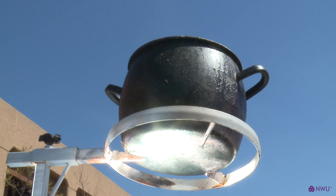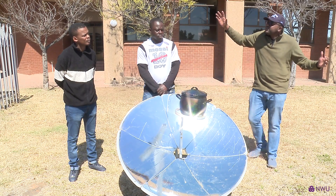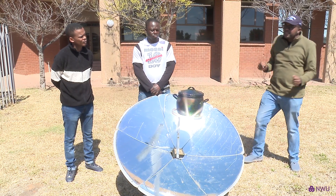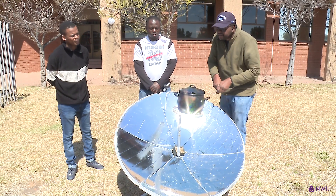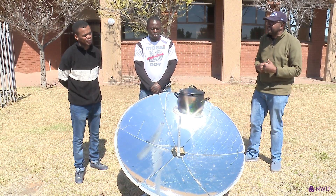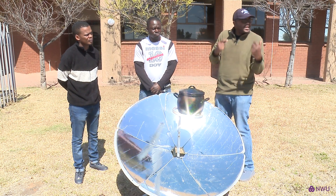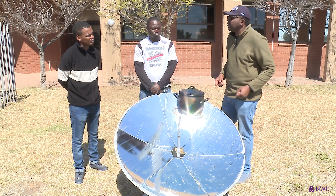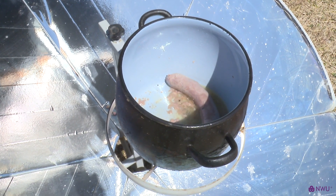One thing that is good: if you want faster cooking speed, you actually make the dish larger. The larger the area, the more energy you can cook your food with. The blacker the pot, the more you can absorb solar radiation. To improve the performance, you have all of this. In this lab, besides testing solar cookers, we also test solar cookers with a storage material.